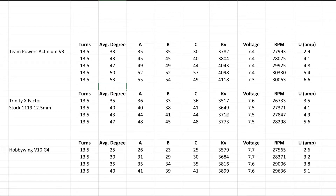I would look at the amps and compare across motors. RPM is just a product of voltage, and since the voltages aren't exactly the same these won't correlate directly — though you could calculate it mathematically. Looking at the closest amp match: one motor is 3.8 amps with 100 KV more. At approximately the same amps the HobbyWing is over 100 KV ahead — realistically about 175 KV more. Multiply that by voltage and you're looking at quite a difference in RPM.